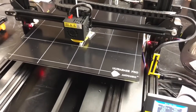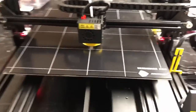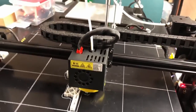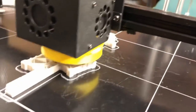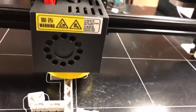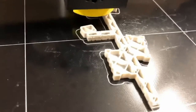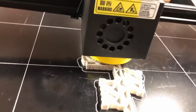I went through three or four slicer profiles and finally found one — I'll get into that in a second. From the Facebook user group, a guy named Chris Wilkowski redesigned a revision six cooling duct system. The original one only blows from one side and I was probably running my PLA a little too hot, so I noticed softened detail on the left side of my prints. I put this new duct on and that solved it completely.